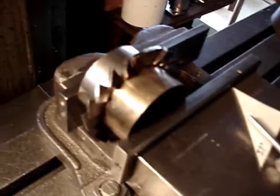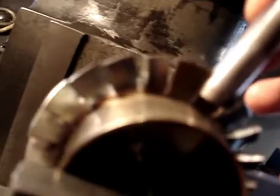You need two support rings on either side of the turbine to support it during the bending process. You also need to make sure that the claw tool just fits down about two thirds of the way on the blade. If it goes all the way down the blade when you go to twist it, you'll just tear the turbine blades right there.